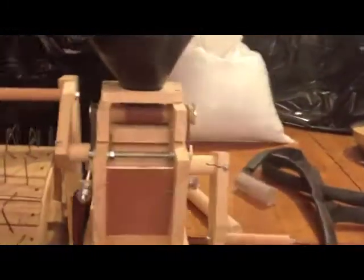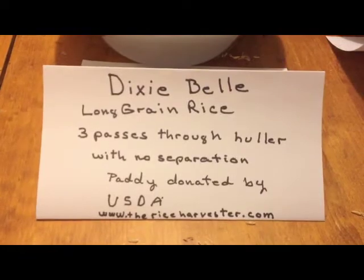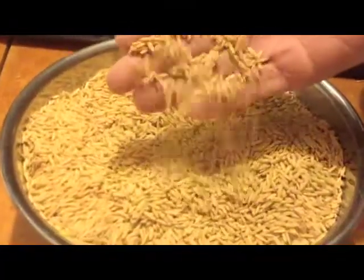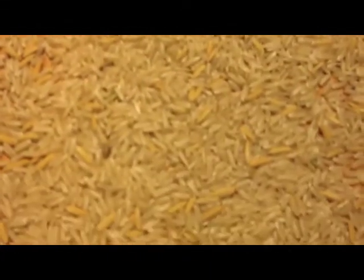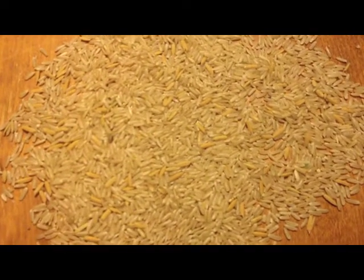Using this huller, we are able to do the rice that's over here on the table. What we have is a long grain rice that we got from the USDA. Our separator won't work with this, so here's what it looks like — that's a long grain rice. This is actually called paddy because it still has the husks on it. Running it three times without a separator, we got it to the high 90s percent.